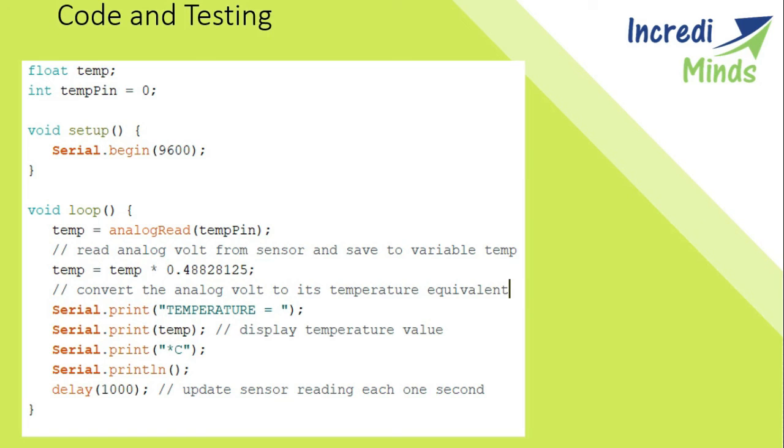Based on the formula: ADC value equals sample multiplied by 1024, divided by the reference voltage of 5 volts. With a 5-volt reference, the digital approximation equals the input voltage. The result of this code gives a temperature display on the serial port monitor, updated every second. You can get the current value of the temperature on the serial monitor.